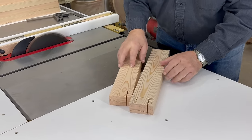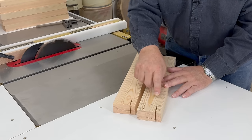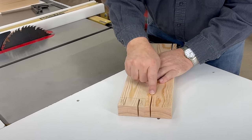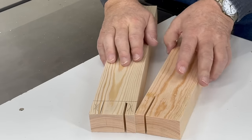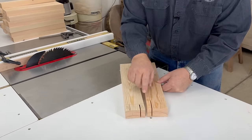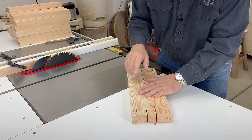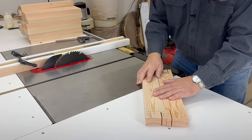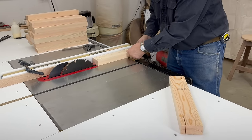You can see how the stop block worked — it stopped my cut. The reason I don't want to go any further is because I don't want a cut that's down into the wood here. This is the back side, to the inside of our planter box. You can see how much further the kerf is because of the curvature of the blade — it cuts further on the inside than on the outside, but because it's on the inside of the planter box, you won't see that. By setting the blade higher, I cut down this distance to a minimum. You have to be careful when you do something like this — that blade is up there. You have a long board, you can work way back. There's no need for your hands to get any closer to the blade than they are right now.